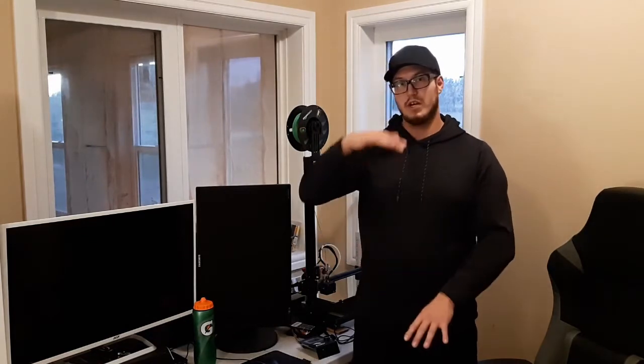I'm done upgrading my printer. I got the Micro Swiss extruder hot end, direct extruder with the hot end, as well as the Ender extender kit, so now I can print 400 by 400 by 500 roughly, give or take a bit.